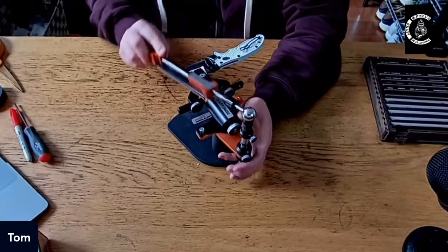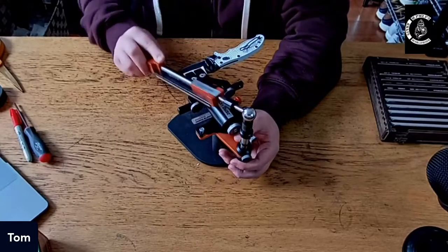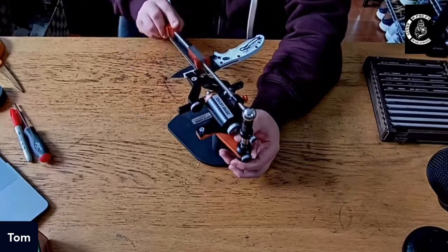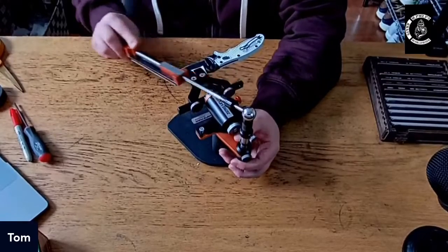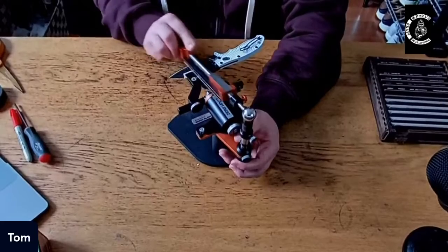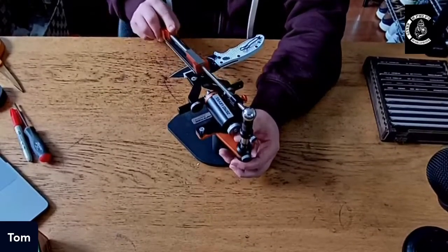And you never want to saw on one spot. You want to keep on moving. I like to do strokes in this direction, forward strokes as my baseline. But then I also like to do backward strokes to kind of mix it up and change the scratch pattern a little bit to see where it's cutting. To see if when you switch your scratch pattern, there's any spots that still have a different sheen than the rest of the edge, like they're not getting hit.